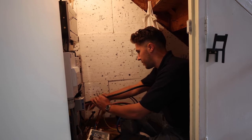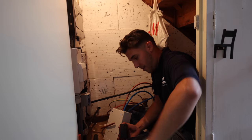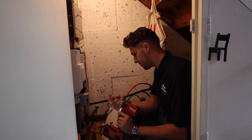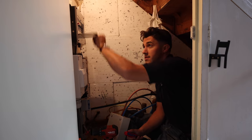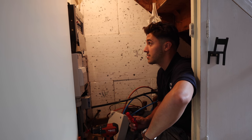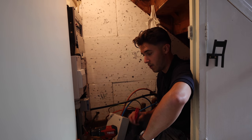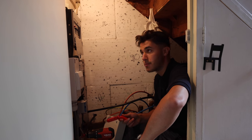I thought of another way this episode might be useful and educational. If you're in a situation where your customer wants you to add things - new sockets, new circuits - the ideal circumstance would be to replace the consumer unit and start again if it doesn't meet regs. But say you want to put in a garden circuit and there's no RCD, and that means doing an inspection on the whole house, changing this and that - it can ladder up into a lot of work. It can be an option to present the client two options.